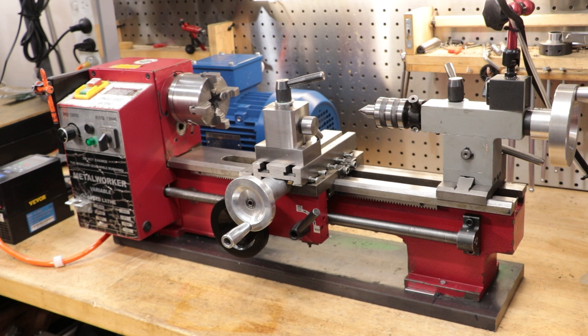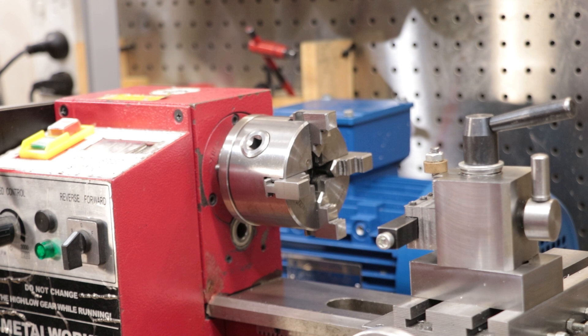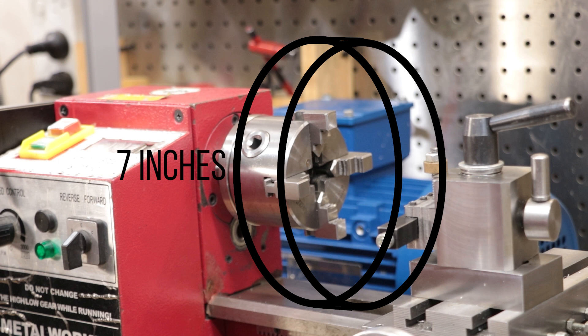For those of you who are new to my channel, this is my Sieg C3 — it's a 7x14 mini lathe. Sieg is the company that makes this one, but there are other 7x14 lathes on the market sold under different names, and from what I can tell they are all pretty similar. The 7x14 refers to the size of the lathe, so this machine could theoretically hold a 7-inch diameter piece of plate — anything larger and you'd hit the bed.